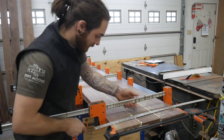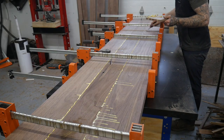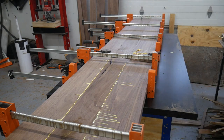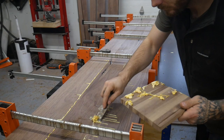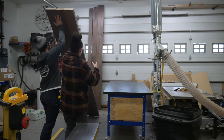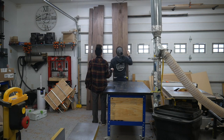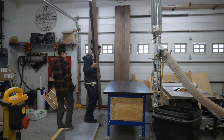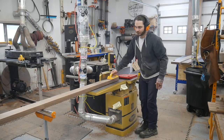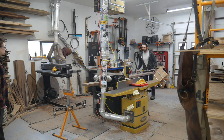So just take the extra minute and check for flatness. There are a lot of ways of dealing with glue — I prefer to wait 30-40 minutes and then just scrape it off, and while I was there I just filled any small voids with epoxy. Now that this piece is out of the clamps we're gonna do exactly the same thing for the other panel. These were already milled most of the way — I'm just doing the final cleanup passes to get them nice and square after they sat for a few days.